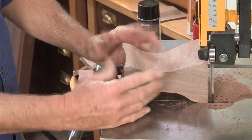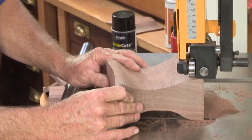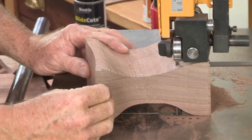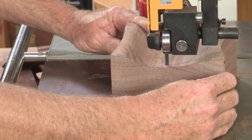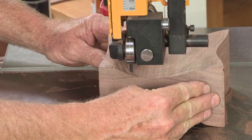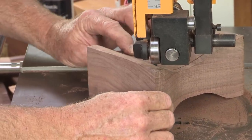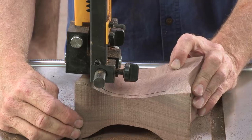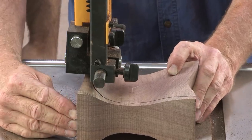Here we go — I'm going to start this and then let you take over. Flat to the table. You always position your hands and fingers outside of the plane of the blade, and that way you will never get hurt. When you come to a curve, think about the radius of a half dollar — you can walk right around the corner. This is the end grain; we want to make that about a half an inch thick because it could crack on the end grain.